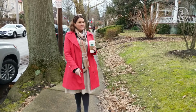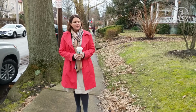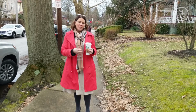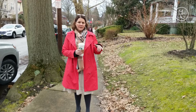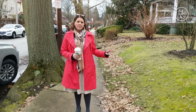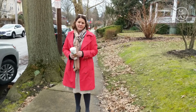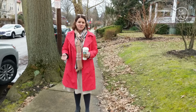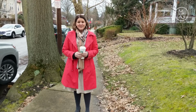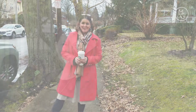Luckily, in this instance, Karen didn't have to worry about it. It was fine. But she is going to have to do yearly maintenance because of the trees, and they're automatically attracted to the water that's in the sewer line, so they want to kind of break in. As soon as that happens, you can do one of two things: dig the whole thing up and put a new one in, or get a blown liner through. Hopefully if you can do that, that's the cheaper way to go. Still not that cheap, but that's the advantage of working down in the city. You need all of those camera scopes.